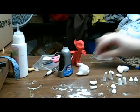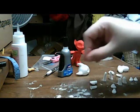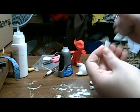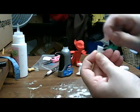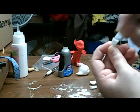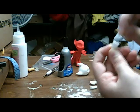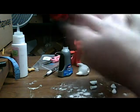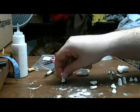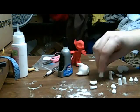If you do have particles or powder left in your parts, I generally just take my bit of wire and scrape along the walls, and then make sure to kind of stab a little and dig it out of any of the crevices. Then you can just give a little shake right above your workspace, make sure it's clean, and you can give it a little tap to help get it out.